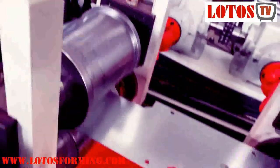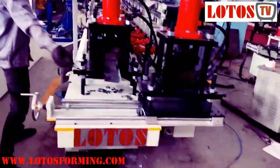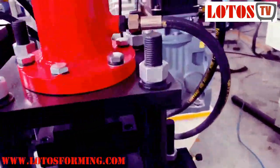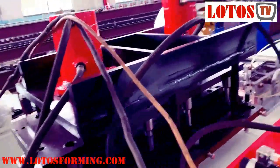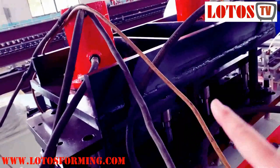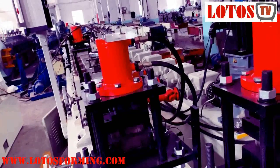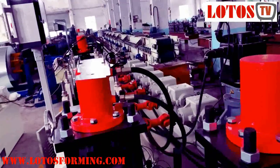This punch unit — we can see the result can punch the holes and the clips. We have two units of cutting cylinder as well as two cylinders for the punching unit. We call them number one and number two punching cylinders. Once we use a punching unit, the cutting will match with it — if we need the number one punching die, we will shift to that cutting unit so the cutting shall be matched with the punching.